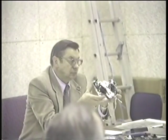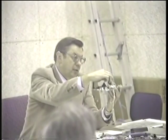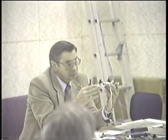All machines with that type of assembly, sooner or later you have to replace the complete chassis, the metal part. It's got a little metal bushing underneath it, touching the motor. So you have to replace the chassis, because that wears. And the motor, the little stage assembly, it rubs with the coil. How about replacing the bushing? No. It's built right in.